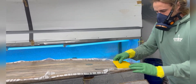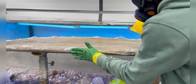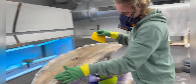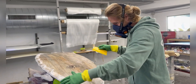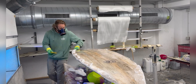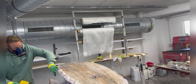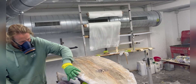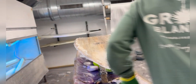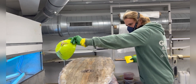So that's the technique of how to float the lap really nicely. I just push this little pocket that we created down so the little lake of epoxy in that fiber pocket floats it really nicely. With the waterfall technique, the epoxy just runs down the fiber and sometimes doesn't really wet the fiber. Just push it down a bit — you can wrap it around the rails, push it under the apex point, and it will get floated even more.